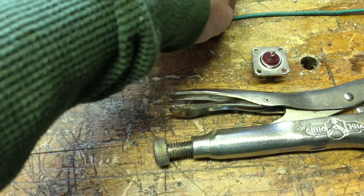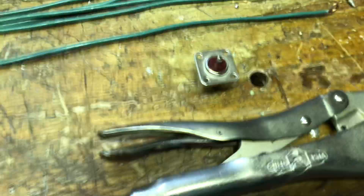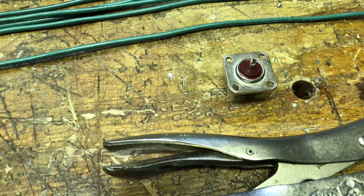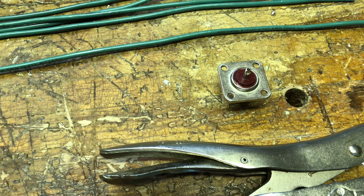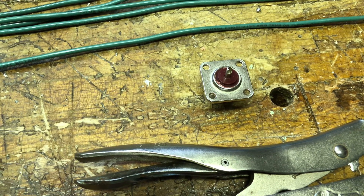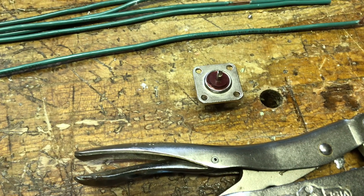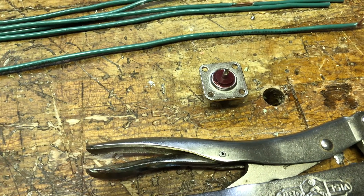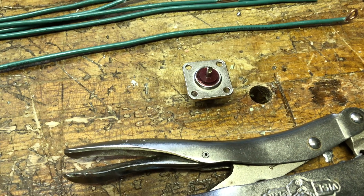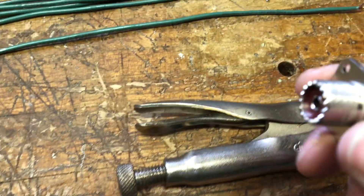The magic number when you pitch these down is going to be 45 degrees. If you don't have them at 45 degrees, your impedance is around 32 ohms. When you pitch them down to 45 degrees — some people say 42 degrees is the magic number — your ohms go to about 50. 50 ohms is your coax that you're running into the bottom here, so that's what you want.